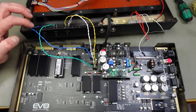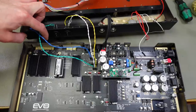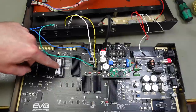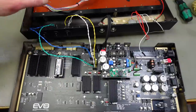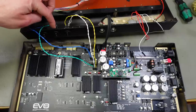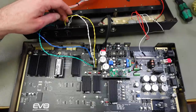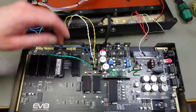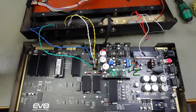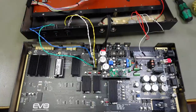So now our buttons here, or our switches, should be a synth card activation, or at least the first cartridge image on the EPROM. We didn't burn the EPROM yet. We should have our SID mode, stereo or dual mono, and we should have the address for the secondary SID switchable on these buttons. We should have audio out now for the pedal wiring.